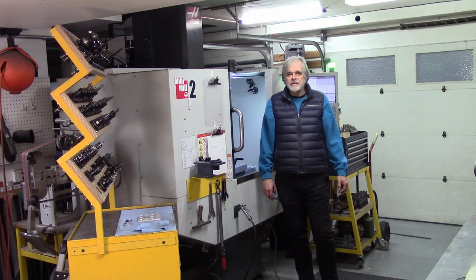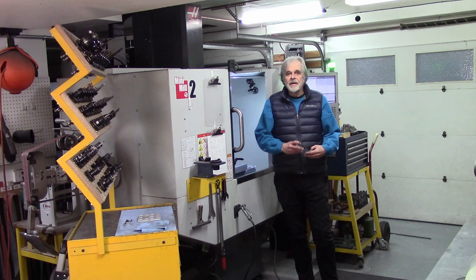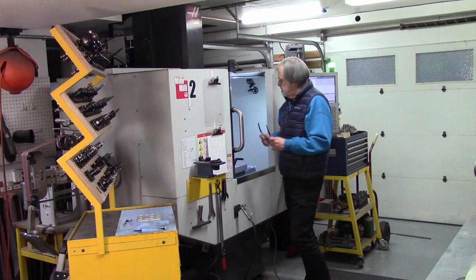I'm in the CAD program, I configured it to give me 2/1000ths of an inch clearance, and I've found that that gives a nice fit. I don't want to have to pound these guys on and then pry them off. I want to have a nice, close hand fit that'll make the part look good when it's done, but not be too insanely difficult to remove. So I haven't set up the tools yet, and this gives a good opportunity to show how I do my tool changes.